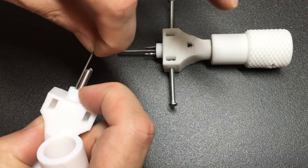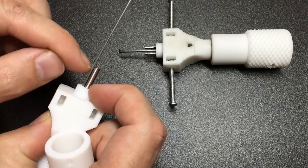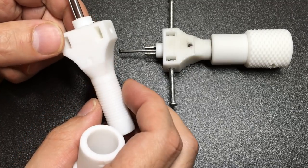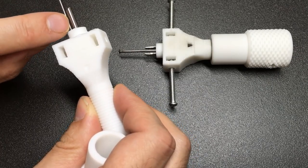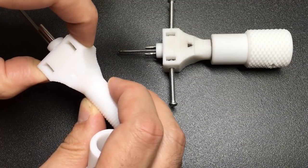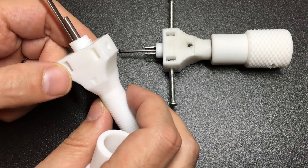Together they'd provide enough depth to extend the metal piece out and the tensioning tips even deeper into the keyway. I'd cut the tension tip off here, allowing all that extra depth to reach into deeper keyways. I need to experiment with it, but filing the sides of the metal tubing flat, moving these closer, and screwing it tight together, I should be able to get good tension on very deep set keyways. That's the principle — and that is the beauty of 3D printed tools: if you don't like something, just print another part.